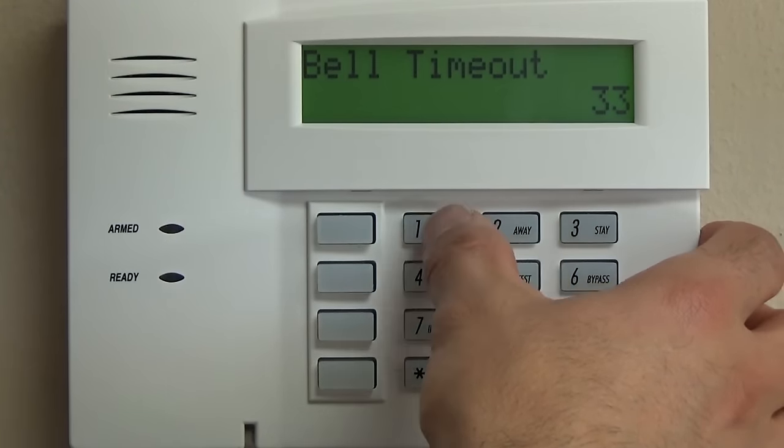So if you have three Tuxedo keypads and Total Connect, you will do 1111. And that's just enabling those AUI slots to be able to talk to the Vista 20P control panel. There's a couple of other configurations that you could probably think of, but that's the basic. So if you have a 6160 keypad only, this can be 0000.